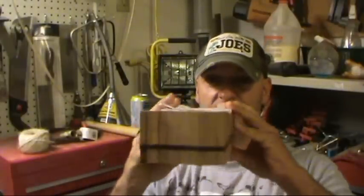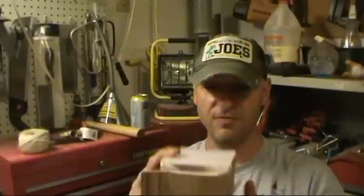So what I did was, before you bandsaw, you actually have to make sure that you have a true 90, a flat surface. I didn't do that because I figured, well, I'm gonna bandsaw the shape out anyway, why do I have to make sure I have a flat surface? Well, in order to have a back to the bandsaw, in other words, you want a backstop, you want a back. So you have to actually cut about an eighth of an inch off the back, put that aside, and then bandsaw your shape. I didn't do that.